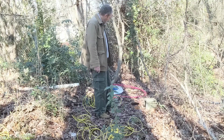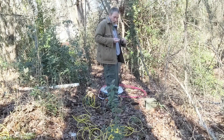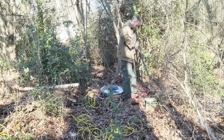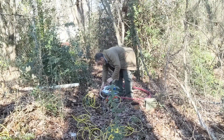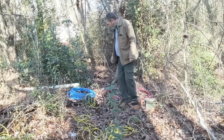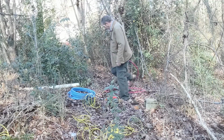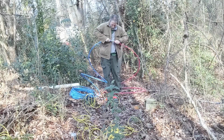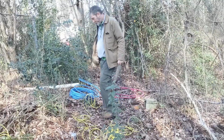All right, so I got the well pump tied off to the fence just in case I screw up and drop it. Got the first 20 feet of pipe on there. Gonna put the check valve on there, make sure I get that in the right direction. All right. I got the 100-foot roll of PEX unbound, and hook it up to this one, then we'll start sending it. All right, she's all together. Got some electrical tape in my pocket so I can start taping this together as it goes.